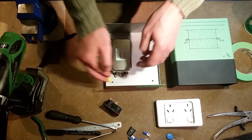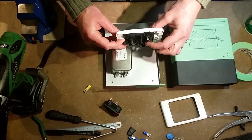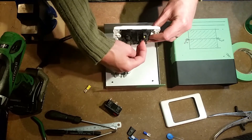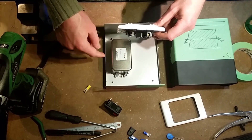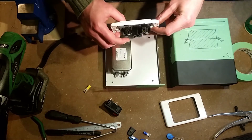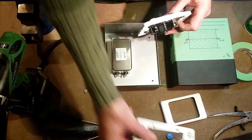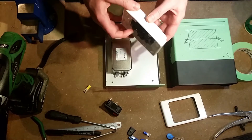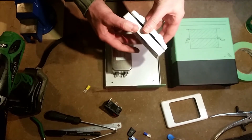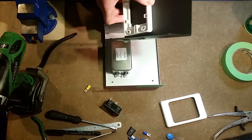With the plug that we see here, the wires actually come in on the left hand side as well, so that actually works out pretty good. When the cables are here they're not going to be hampered. The line filter will sit about at least five mil from the bottom. And my back plate — that's basically just so my screws can screw into it — will go on the back of the project box like so.